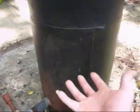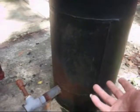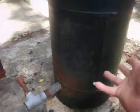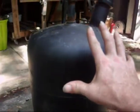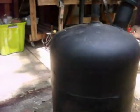up through the charcoal, it's usually carbon monoxide, a little bit of carbon dioxide, some hydrogen, tiny bits of methane, whatever. All that's burnable. Okay, so it comes up here, and right here you don't want it to mix with air. If you get any oxygen in it, you basically made a bomb. You don't want to do that because if it flashes back, it'll blow up. Right now, if it flashes back, there's no air in there, so it can't burn. So anyway, this doesn't have to be airtight down here.